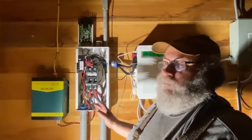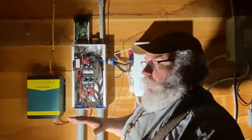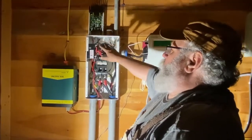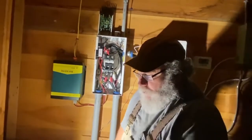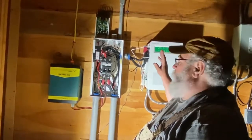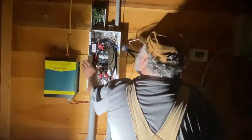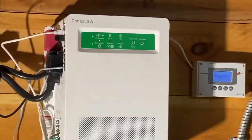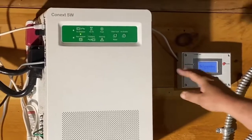When you turn a system like this back on, the first thing you want to do is turn on the power from the batteries to the inverter. If you turned on the array first, it would go through the charge controller but wouldn't have any place to go because the battery side is shut off — that's bad. So you always want to turn your batteries on first, then power up the inverters. As you can see, all the lights have come back on here in the basement and the inverter's firing up.